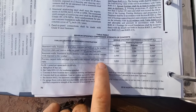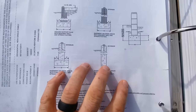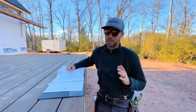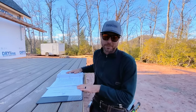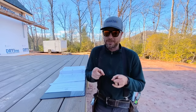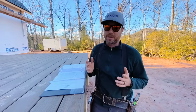You will also find in Section 4 the compressive values of the concrete needed for different weathering situations — that is handy. As well as the charts in Chapter 4 about the footings, there are many detailed drawings about how exactly your footing should be built. I want to talk about one thing that you won't see in this codebook about footings, at least in my codebook for this area, and that's a requirement for steel. In this area it's actually not required, but we do it anyway. We do two rows of number five steel in the footings unless the soil has a soft spot, and then we'll do three or four or more, because it's really cheap insurance to make sure your house isn't going anywhere.